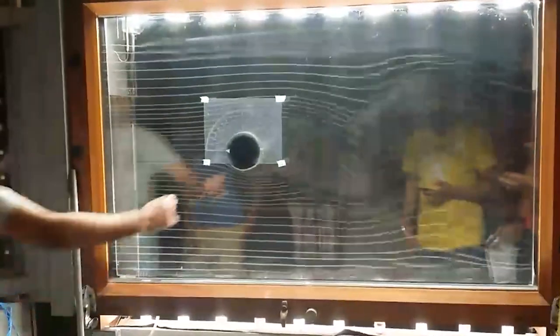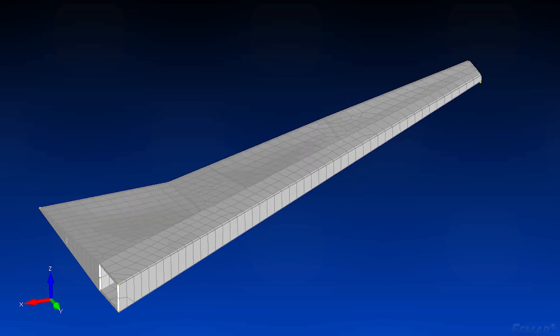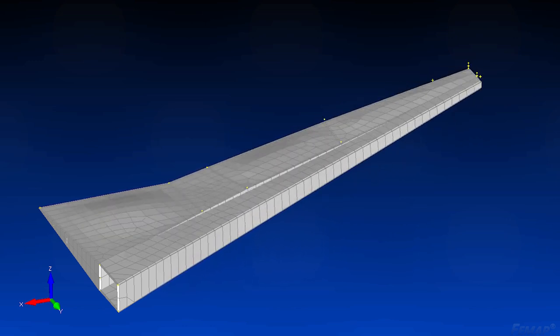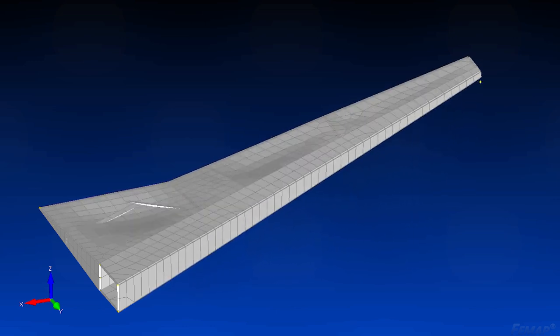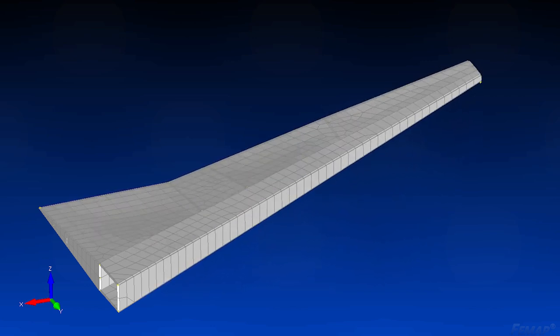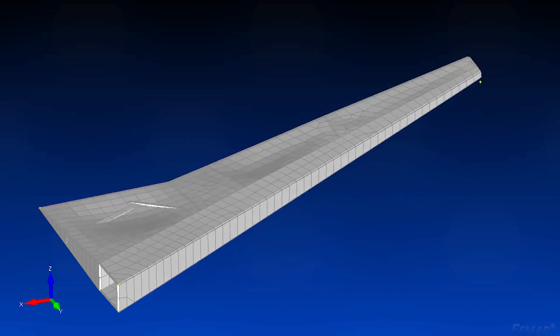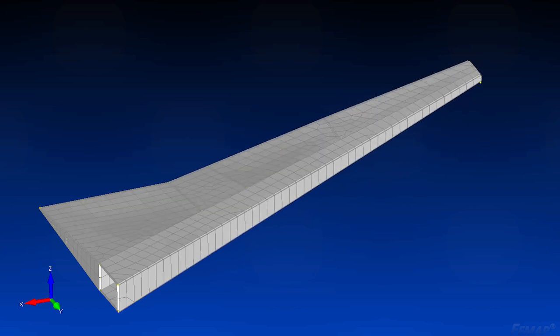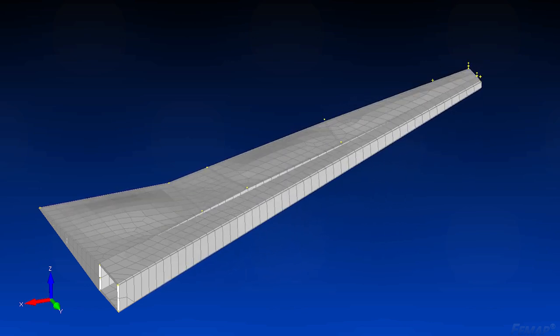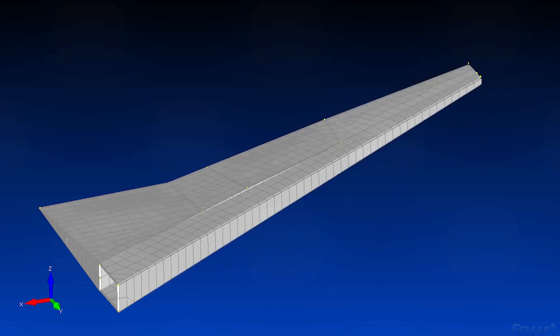The computer models also had skin added, which for skin, I had selected paper, which has a surprisingly strong tensile strength and is very, very light, which is another great thing if you're trying to fly slow and keep the aircraft as light as possible. The skin contributes a lot to the overall structural rigidity and strength of the airframe. So adding that in and the material properties really boosted the analysis, and it made it have a lot higher fidelity and showed that this is a feasible project.